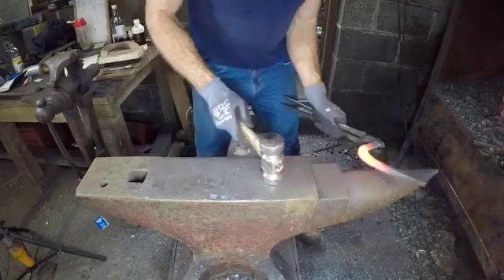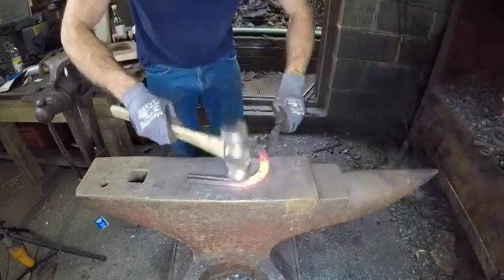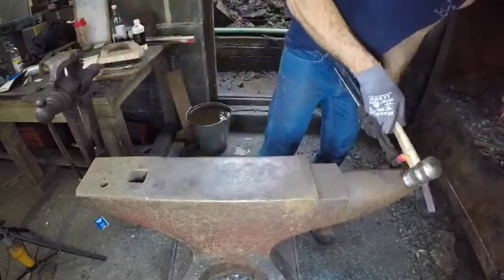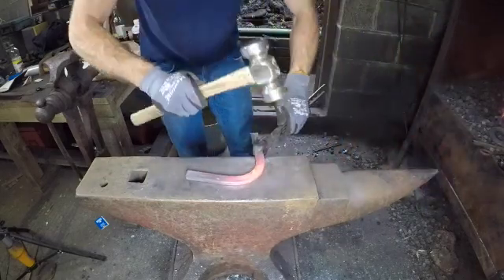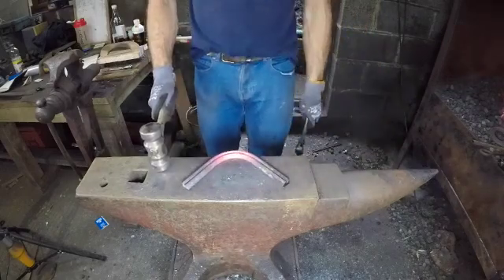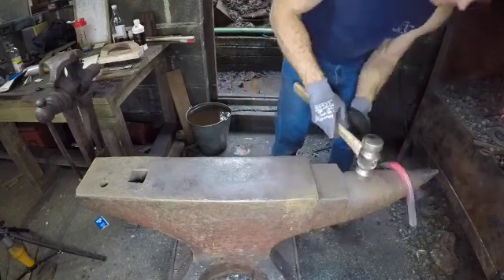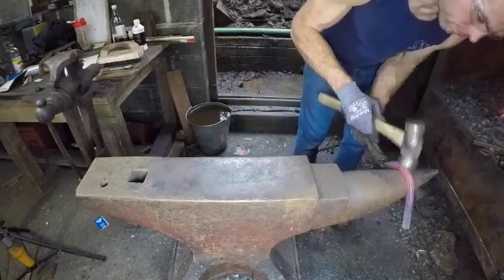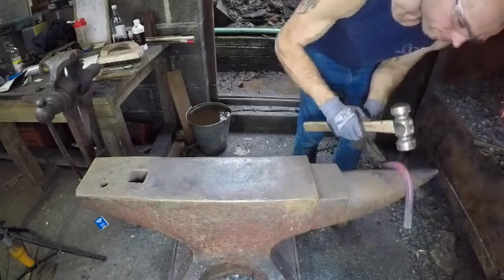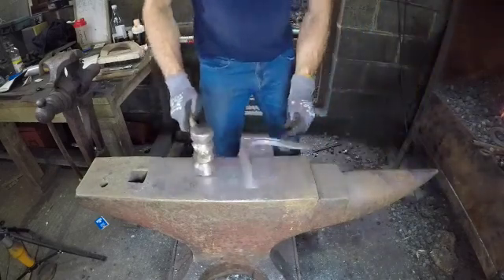I'm always keeping the steel level as I'm working it, then I check how we've got the rough shape of the toe mapped out. If it's symmetrical you can pretty much leave it as it is. If it's not quite symmetrical you have to make minor adjustments using the beak. You never want to squash a concave section between your hammer and the beak — work just over or behind the beak so that you don't squash it. Once the toe is pretty much shaped, place it on the beak at a radius that suits the size of the shoe and lightly run around the outside for a lovely rounded radius.